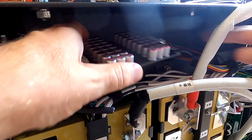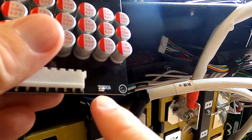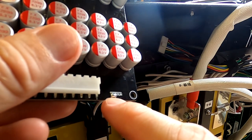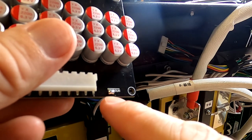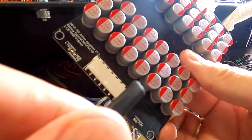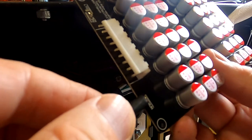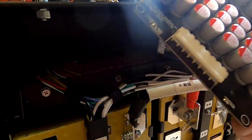Alrighty. So what you want to do is, as commonly known, there is this solder here where it says run, and there are two contacts underneath which are bridged with a solder. And we have to remove this one and have to solder these two contacts onto our two cables. And then when we close the switch, it actually closes the contacts and starts the balancer.